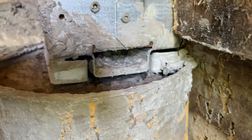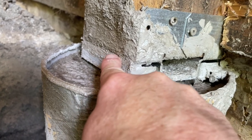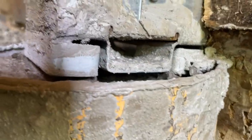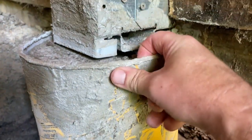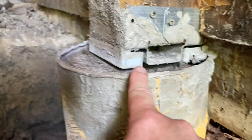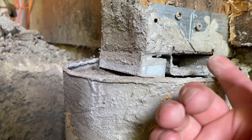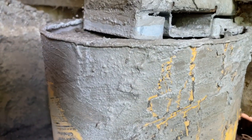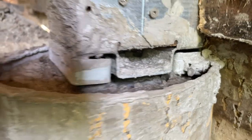You can see a little bit of a fail here - learned something important. I had mounded the concrete up to the top of the tube and up to the top of the post mount, knowing it would settle in a little bit, but it settled a lot further than I thought - first time ever doing this. You can see the gap underneath, so this whole post is sitting on that thing but the anchor bolt is barely engaged. The concrete shrunk a bit. On all the rest of the posts, I'll be raising the tube higher instead of leaving it at plate level. I'll go up higher and then mound the concrete higher, knowing it's going to drop down. A 48-inch tube settled probably about three-quarters of an inch.